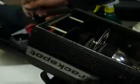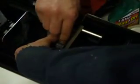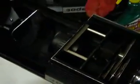Alright, so now we've just cleaned the two lenses. Now you can slide this back in. Now I didn't mark the focus point because I always refocus them when I hang them up, but if you have your own, you might want to mark the focus point with a piece of tape right here.